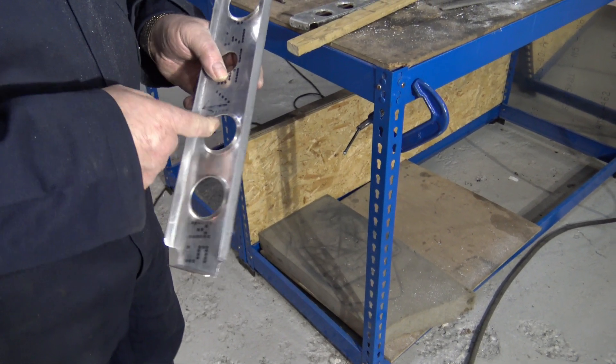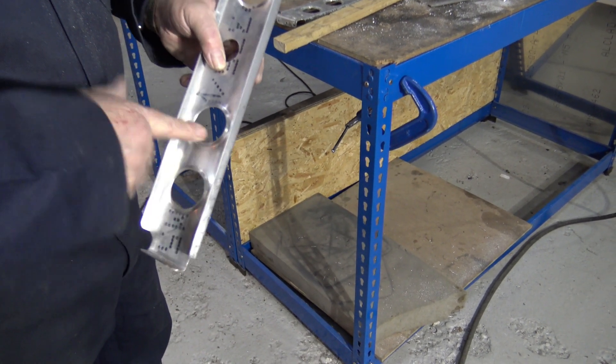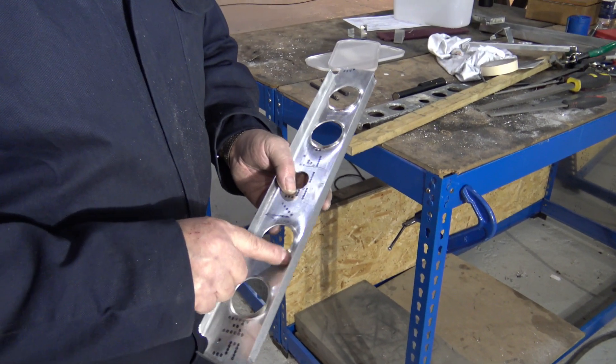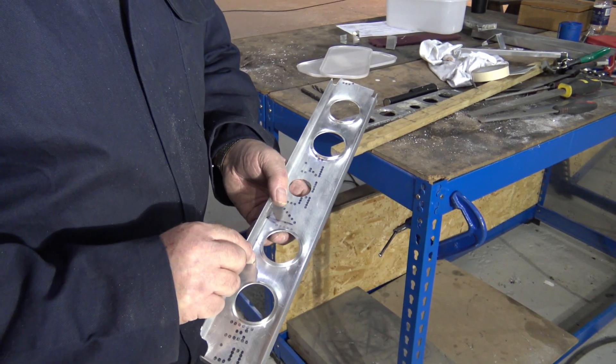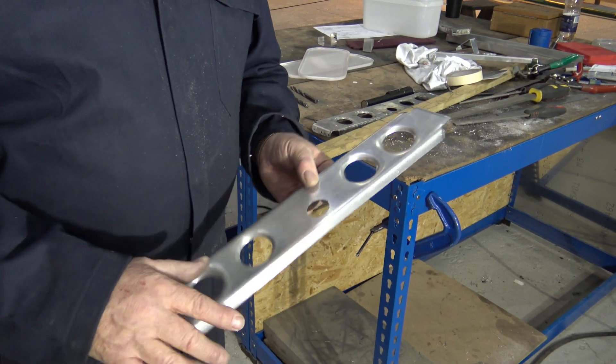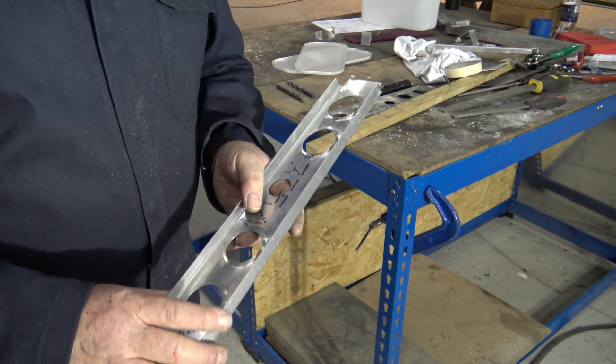You can put a little radius on there with some Scotch-Brite to smooth it off. And then when you put the tool in to give it the lightning — the sort of joggle bit. Did you heat it up at all? No, just the press. You can't do that with this — it's T3, you'll change the spec of the material. T3 — is it? Yeah, it becomes too soft.